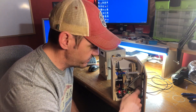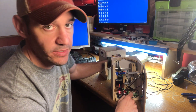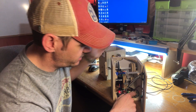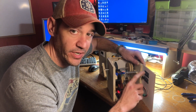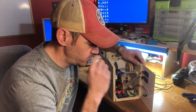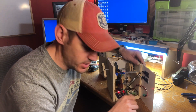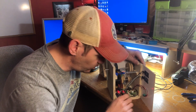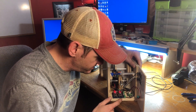Basically all I've done is mounted all this stuff in here. I've got the wire coming in, going through a fuse, coming in to the Arduino boards, coming out of the Arduino boards and going to the speed controller. The wire comes out of the speed controller, goes to the switch here in the back, and then comes out of the switch and goes to the motor.